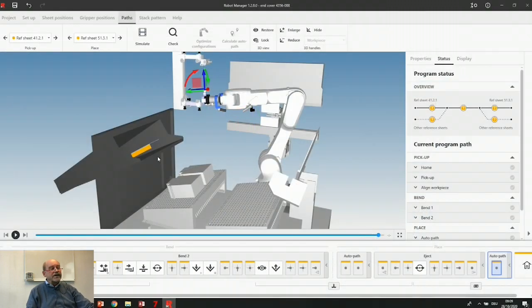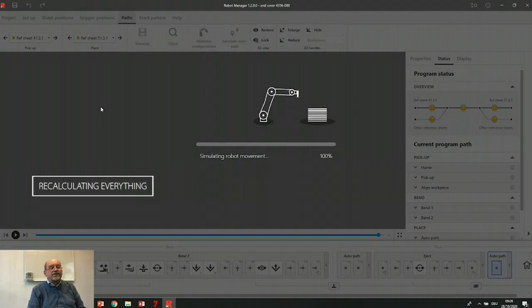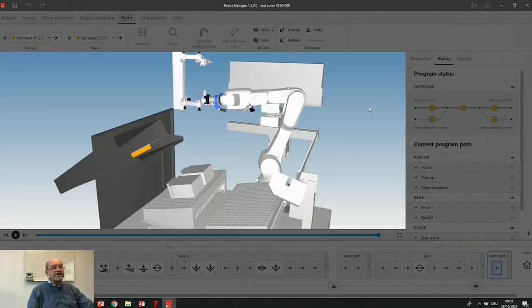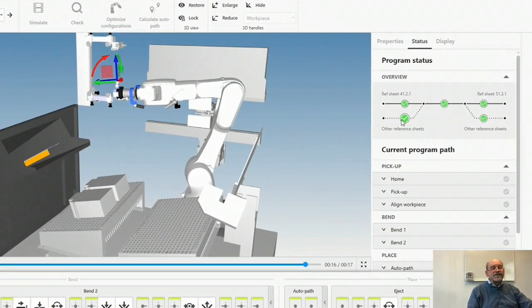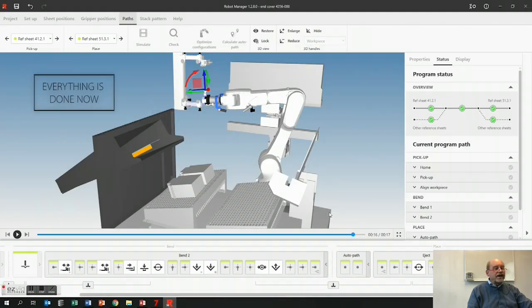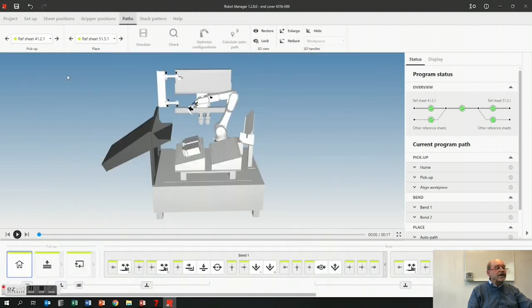I need to calculate these parts because I've added positions, so I hit check again — it will recalculate everything. The middle bit will stay the same because I didn't change that. And now I have new positions — everything is green. The pickup positions are here, and these are the chute positions. Everything is done now. I can run this — I can choose here which one I want to see. This is the first one, reference position here, it's the middle one. So let's simulate this.